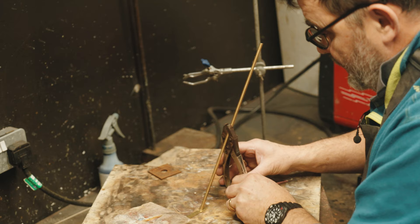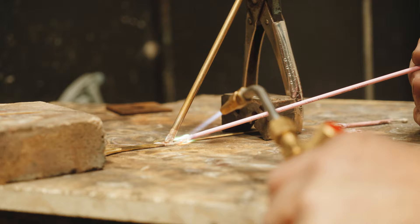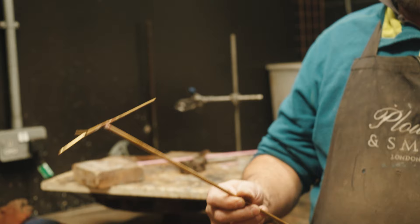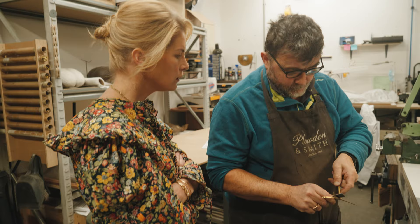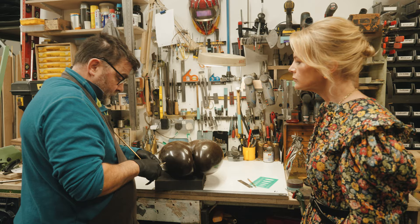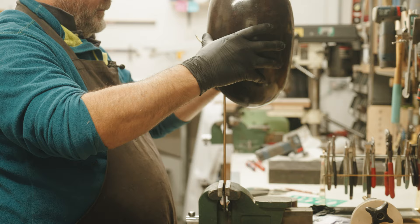Different brasses have different quantities of metal in them, so some are brittle — if you kind of bend it, it breaks. So if you anneal it, it aligns all the molecules so it's more flexible. But when we actually finish the object, it's lined with a felt or a polyester or something, so although brass is an inert metal and shouldn't react with anything — just in case.